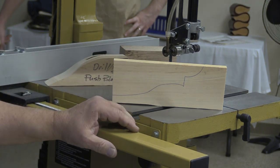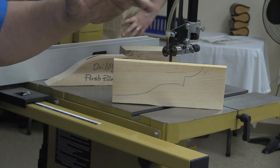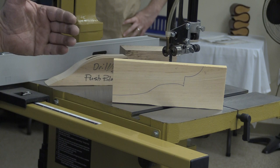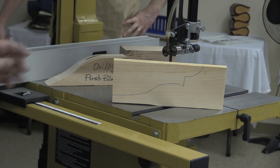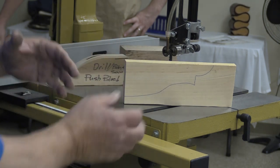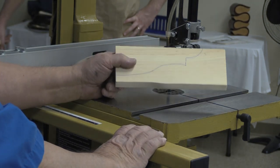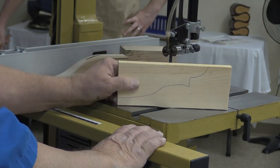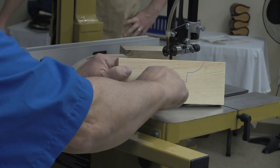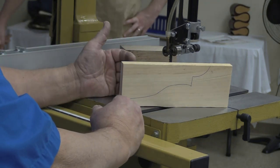When we were doing the canes, you could only go so far with a bandsaw, and you don't want to back your bandsaw off 20 something inches and be taking a chance to pull a blade off. So before you start, make your cuts across at different points so you can just drop those pieces off as you get past there instead of having to go back. It sounds simple, but if you take that bandsaw all the way there, and if it's straight, it's not bad, but if you've got a curve on there and have to back it off and make that curve and get out of there, a lot of times you pull the blade off of the wheel doing it.